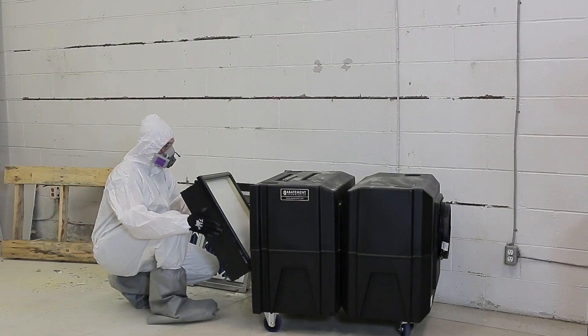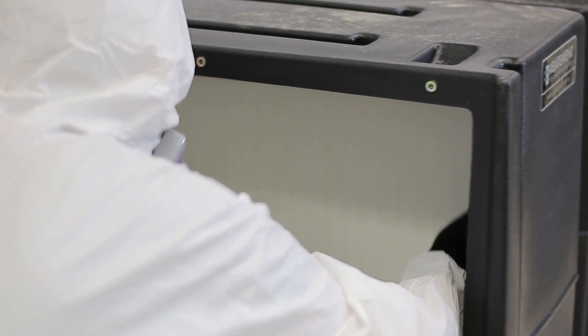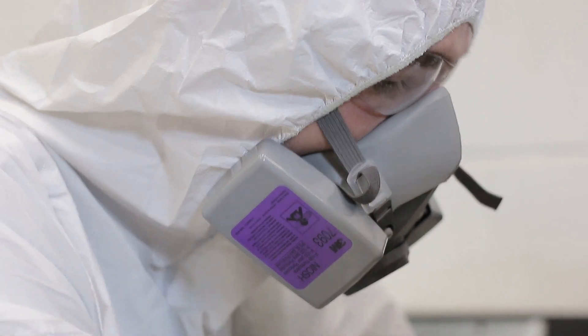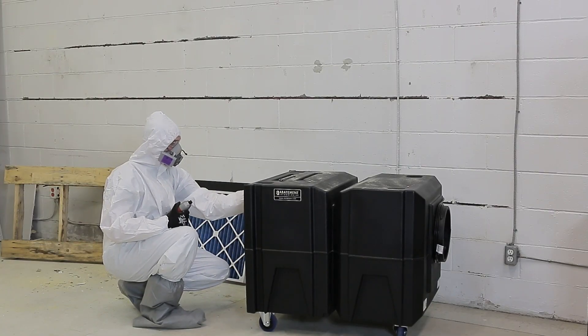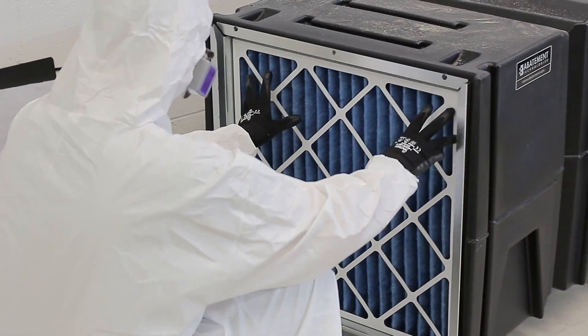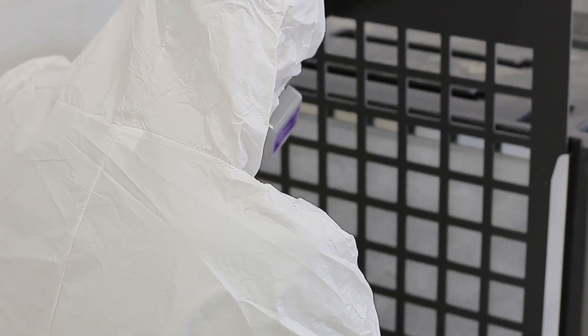Carefully slide a new HEPA filter into the cabinet, gasketed end first, so that it sits flush and square against the sealing surface of the opening in the cabinet. Reattach the HEPA filter retaining brackets to secure the filter in its proper position. Do not over tighten the bolts. Replace the pre-filter metal frame and screw it securely back in place, then position the pre-filters back into the opening if not done already. Place the access door grill back in the metal frame.